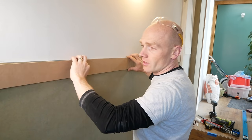Upstairs yesterday, I used the airless sprayer, sprayed all the rooms, skirting boards, architraves, flawless, smooth finish. It dries so quick that the roll up, I'm just not happy with the finish. So I think I will give this a bit of a rub back and then accept that I might mask up and just give it the final coat, really nice fine spray over the lot. Equally, it's easier to touch up when it's left like this. So it's a bit of a balancing act.